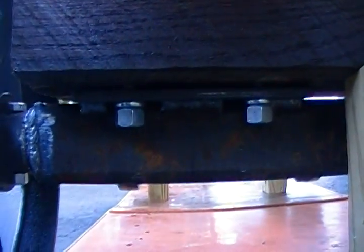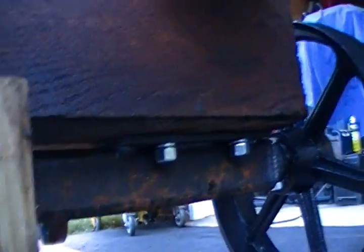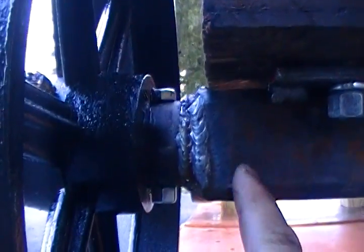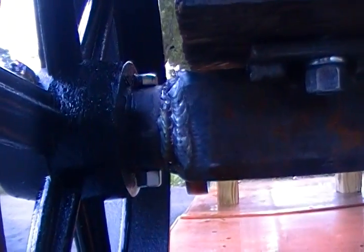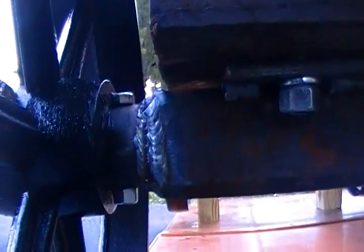The axle for the most part is two by two square tubing, three-eighths wall. For the rear fixed axle I just have a piece of plate welded to it, bolted up with through bolts all the way to the top. The inch and a quarter water pipe was cut and pressed into the two by two tubing just a bit and welded in there securely, so no worries about that.